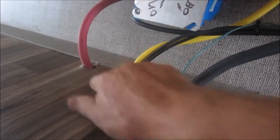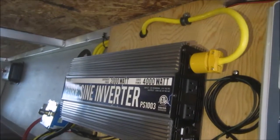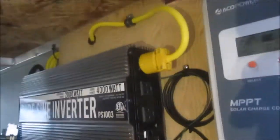Let's go inside. Inside we're going to seal these holes with silicone. The cable comes up. I got a couple extra loops because you don't ever want to be caught short, because you can't stretch it, but you can make it shorter. Now I'm going to put the end on. There it is, all plugged in to the inverter. The spare wire, a little bit of extra wire, is coiled up there in case we ever need to move or have a style change on the inverter.